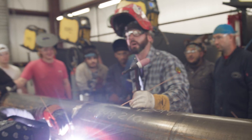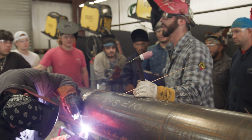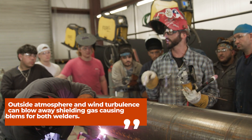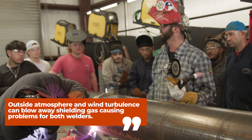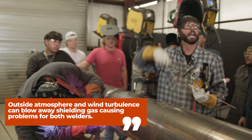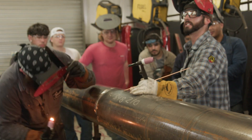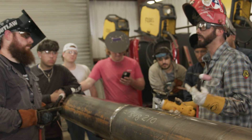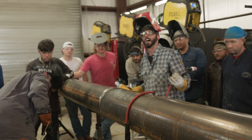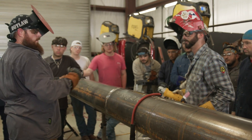Let's play pretend I just made a boo-boo. The problem with lighting up a grinder right here — what's bad for TIG welding? Air. Anything but argon, some inert gas coverage. If I go to grind on this, I'm not only throwing sparks through that bevel, I'm throwing air to the back side of his root. What's that going to do? It's going to give him porosity, and now we're both mad. So when he stops, we communicate — hey, let me feather this real quick.